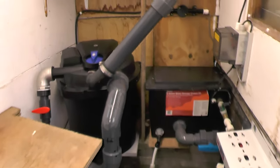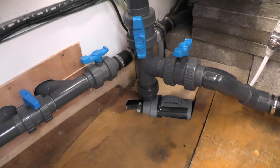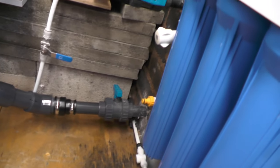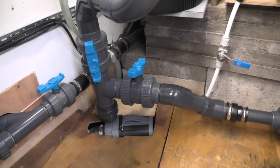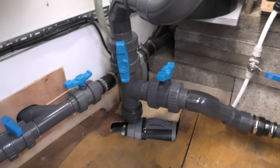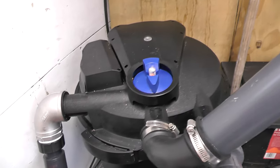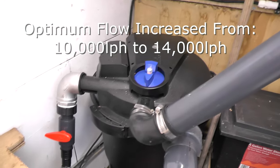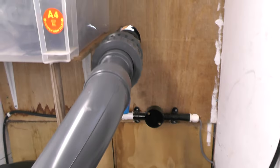That's the finished article. What we've got there is a PondExpert 30,000 VarioFlow pump with a 2-inch outlet into a T-piece. The first option is a bypass back to the pond — at the moment I've got an inch and a half at the pond end, so there's a slight reducer there, but the valve is closed off. Currently the water is pumping directly up through the 2-inch sweeping S-bend into the SpringClean Auto 30,000. So it's got an increased flow rate through the pump, through the filter, and that comes off in 2-inch. It goes up as before — I cut the hole in the wall into the back yard at 2-inch.